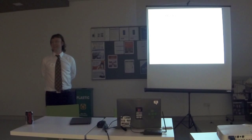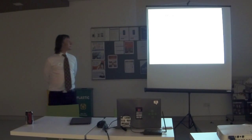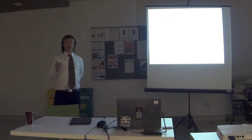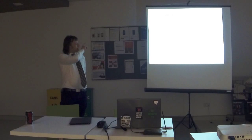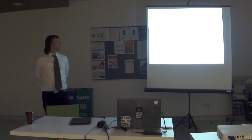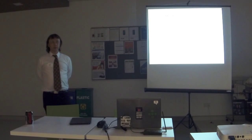From its own board. Then you have the down conversion and up conversion, depending in which direction you use it. You can use it only in one direction at a time. So then, of course, at each stage you have switches that make sure that only one channel is active. Then you have the ability to tune your frequency.